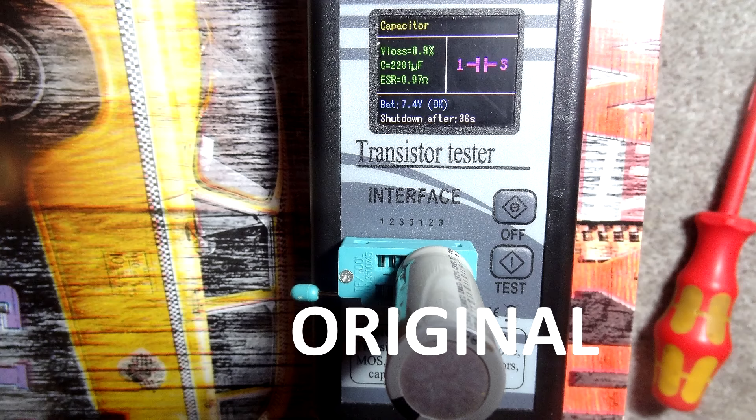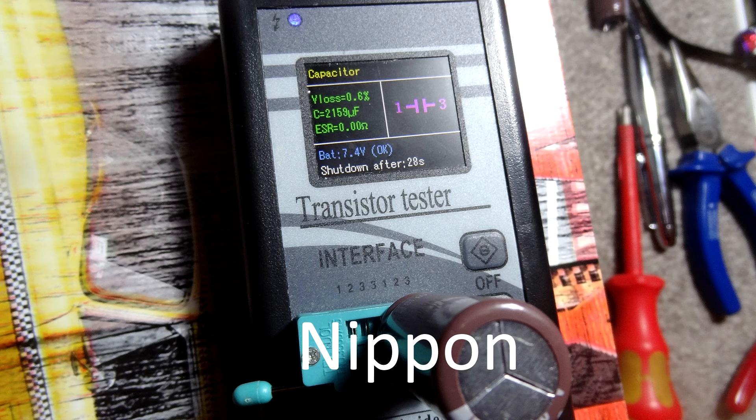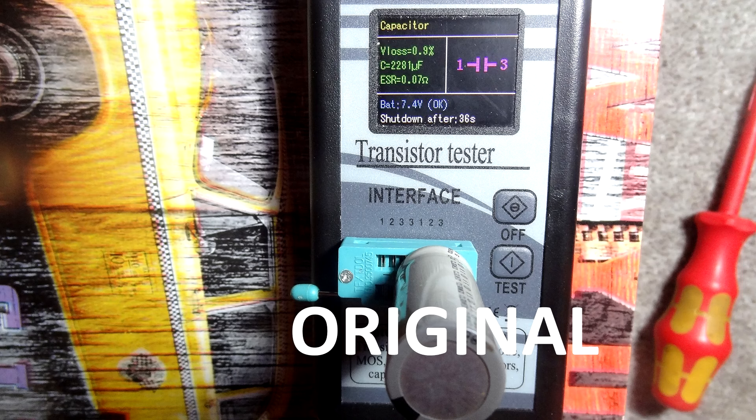So everything has come out really well for this amplifier — I'm really pleased. They're worth changing; you're going to get a little bit more clarity out of it. I quickly put up a picture of the capacitor readings — the V-loss was about 0.5 and the capacitance was near enough dead on. Sorry I didn't get a picture of the ones currently installed, but the original reading looked pretty good. Okay, that's it — thanks for watching and I'll see you all soon.